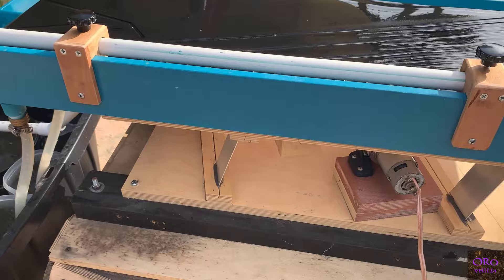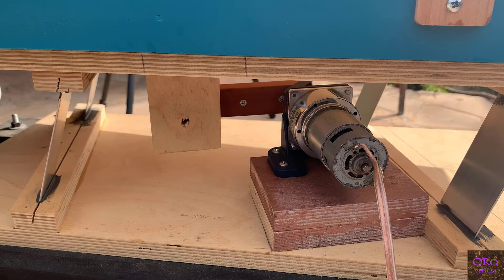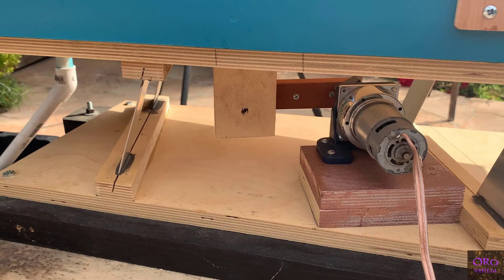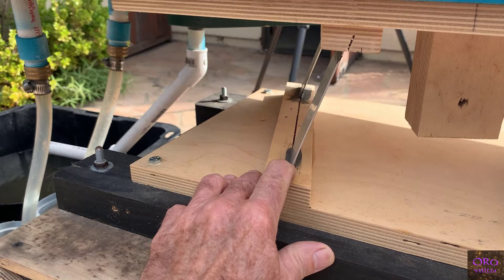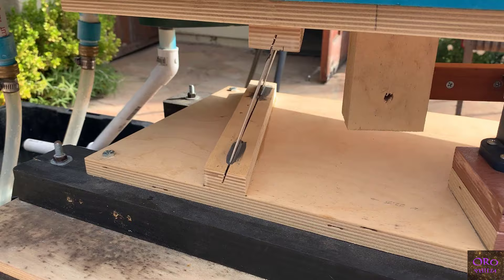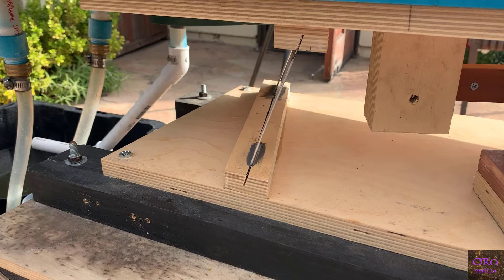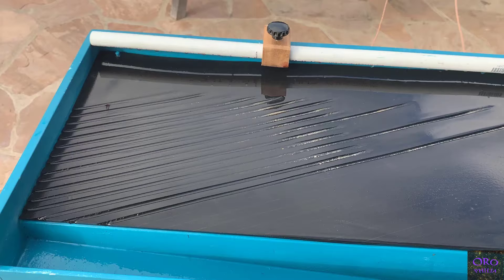There are many other details I'll cover in another video, but briefly: the motor is a 12-volt motor rated at 35 watts. I've run this table as you see it now for about 30 hours total and I don't see any degradation in anything. The flexors are epoxied to the wood — this may not be the best approach for a prototype, but it works. Spring steel or phosphor bronze would probably be better materials. There's also a way to level the table in the frame.